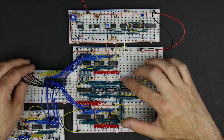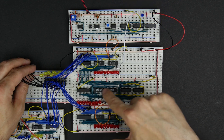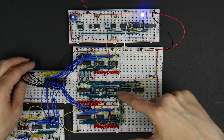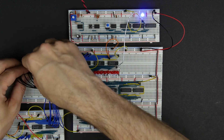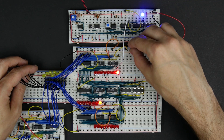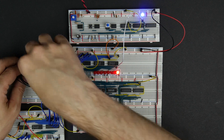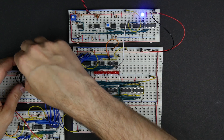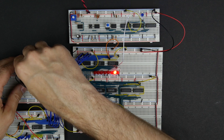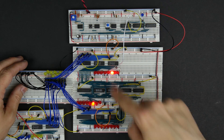My first thought is the simplest part of this was connecting the A register to the adder. If we've got zero in the B register, then whatever is in the A register ought to show up in the output. So I'll put some value in the A register and load it. We loaded a one into the A register and we see a one in the output — one plus zero is one, good. I'll just try each bit. The second bit is connected through. The third bit is connected through — four plus zero equals four.